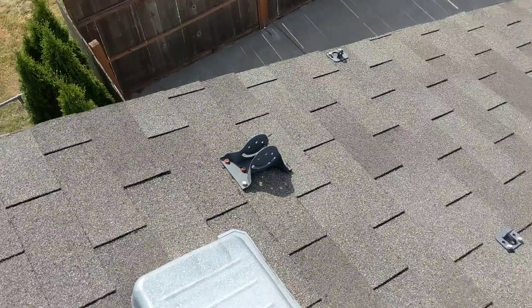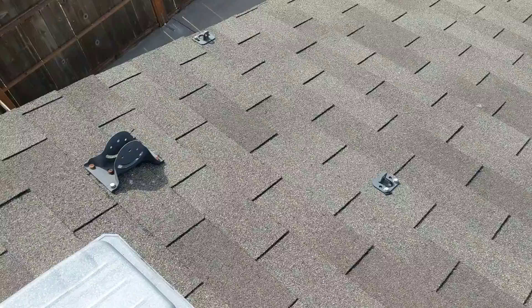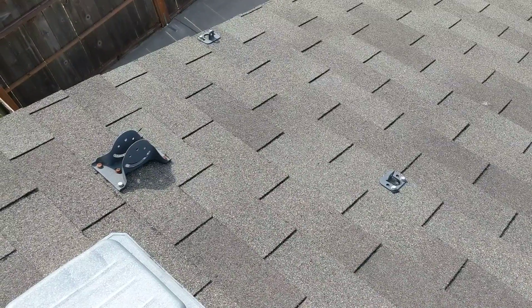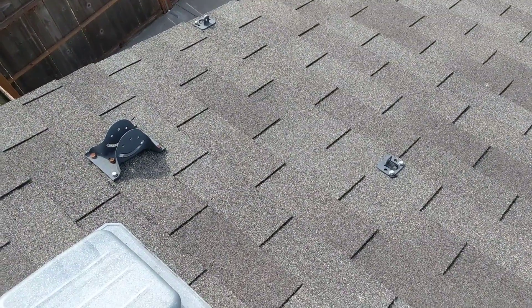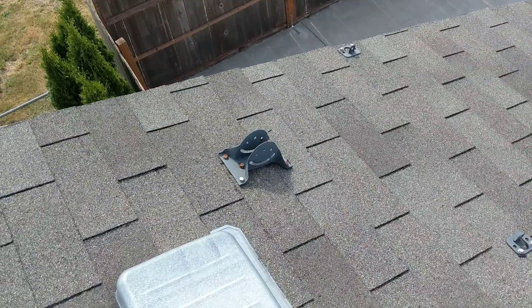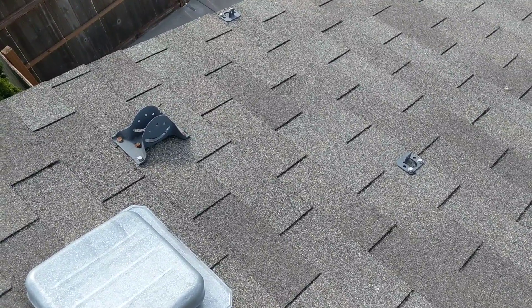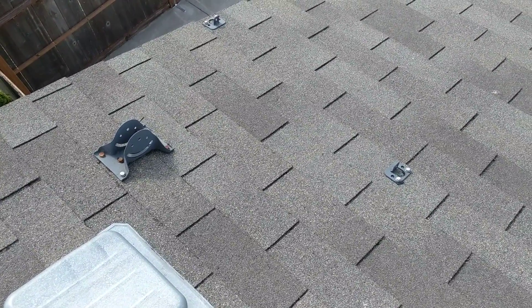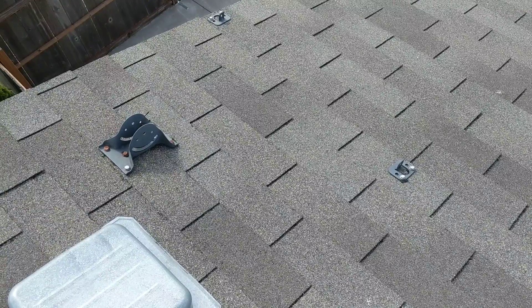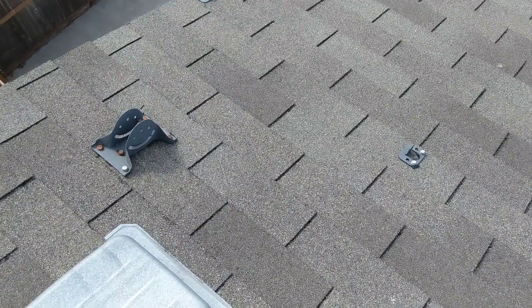The first challenge we'll identify is we have a few roof penetrations. These are screws that were presumably attached to the roof line to hold on to a satellite dish. These fasteners are ideally attached to the area overhanging the exterior portion of the house — the soffit and gable ends, etc. We'd recommend having these screws removed and then resealed, or flashed and then resealed.